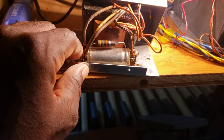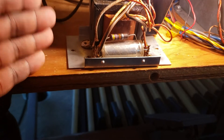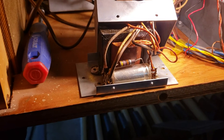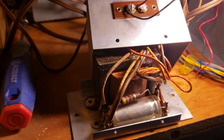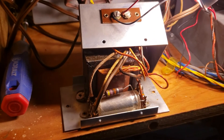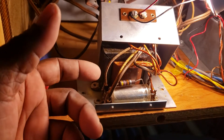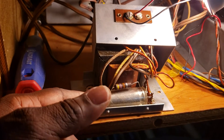Till the next video. Dr. Kemp, the Hammond Doc. Somebody might ask: what is this thing for? This is for the switching aspect of the Leslie amplifier. This is what allows your relay to work and to switch off and on in your Leslie 122 amplifier. So you need one of these kits. The newer forms are called the 8000 kits, but this is the older model — it's called a 428 kit.